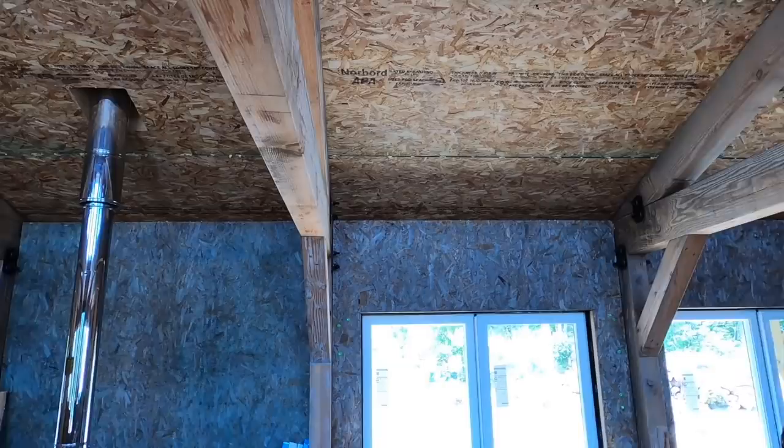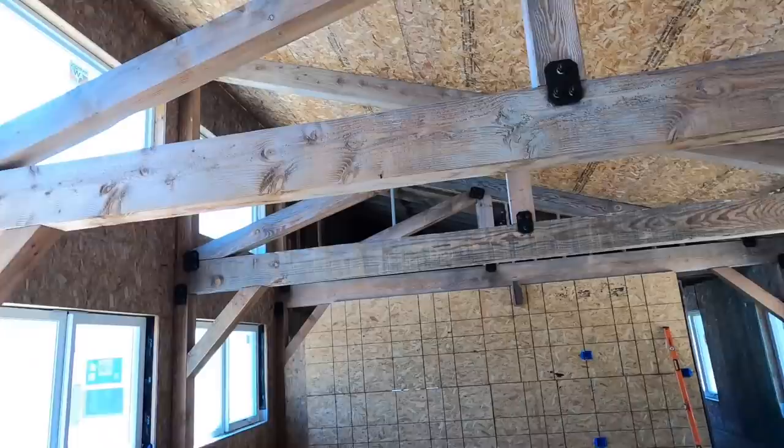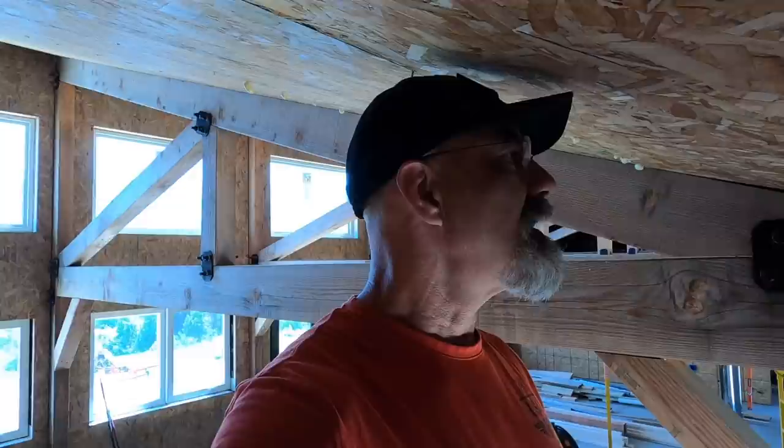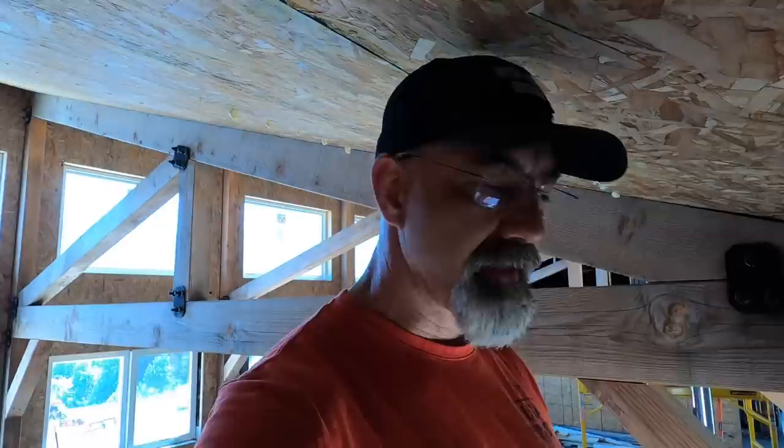The back of these panels is probably the toughest area for me to reach. There's a little gap right here where air is going to come through, and I want to make this place as airtight as I possibly can. The first reason is air movement and moisture — not very efficient for cooling and heating. The second is ants and any insect that'll fit through is coming through it. Even slightly bigger and you'd have vermin, so you need to get everything sealed up.